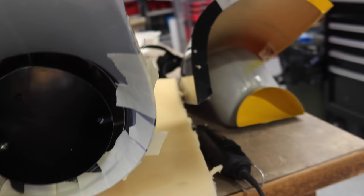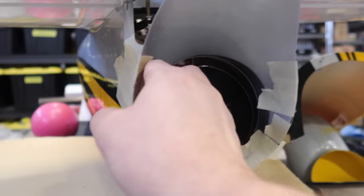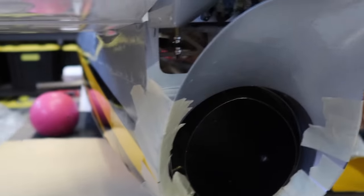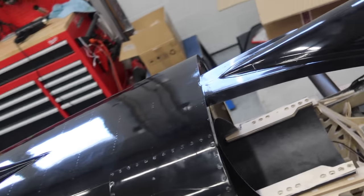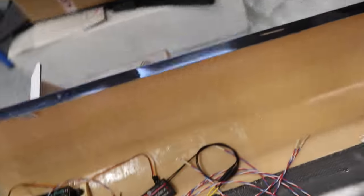We've got the pipe installed and the rear fairing installed. What I did was run glue all the way along the perimeter where the fairing piece sits, installed it, taped it in place, and then lifted the rudder up about four inches to get good access where the fairing meets the fuselage on the top portion. This is all glued in place right now, just waiting to cure. Next we're going to get some lights installed — we've got one red beacon that goes up top here, and the other beacon goes on the underside. There's a marking on the fuselage somewhere in this range for its location, so we'll get those installed and I'll show you the process for installing the unilights.